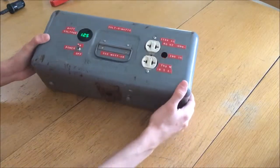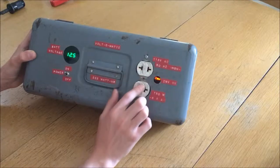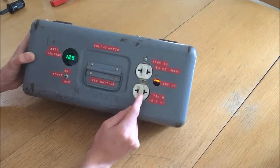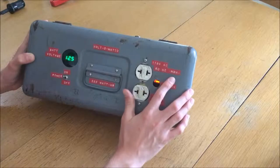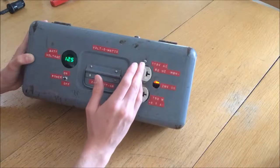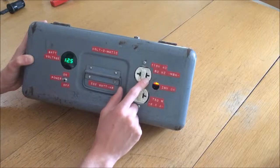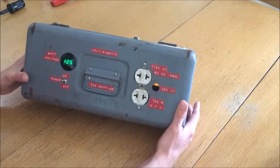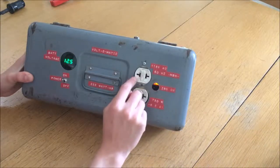In keeping with the style of the old vintage retro metal box, I used an old tandem receptacle. I didn't just include this for the style — I also didn't necessarily want a ground pin connected to the inverter's ground, because modified sine wave inverters generally split the voltage between the hot and the neutral based on the ground pin being at the center, which puts 60 volts between the ground and either one of these pins. That is not necessarily a great thing for all devices.